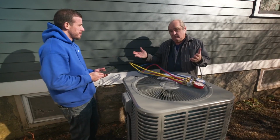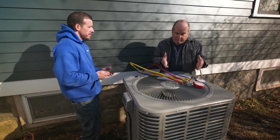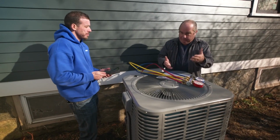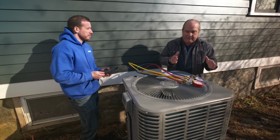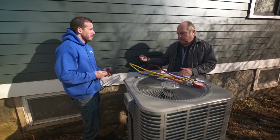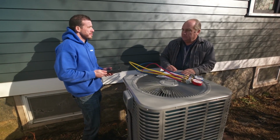So really, what do the homeowners get here? It's got the super efficient cold weather heat pump where for $1 worth of electricity, you get $3 or $4 worth of equivalent heat out of it right here. You get technology that doesn't back you into a corner because you can troubleshoot it. Exactly. And they can control when they decide between using fossil fuel or electricity. What's not to like about that?